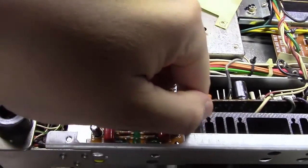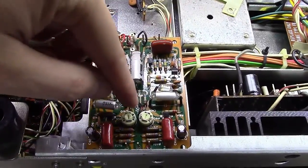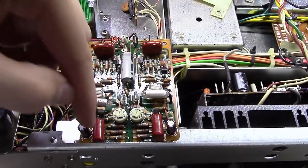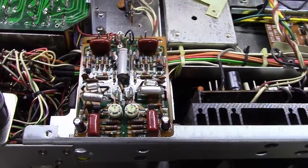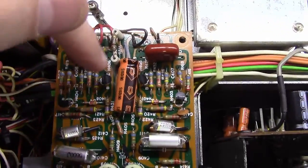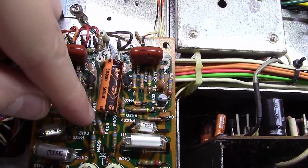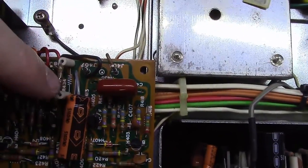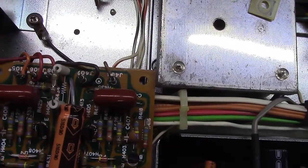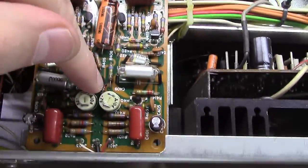We've now replaced capacitor, capacitor, capacitor, capacitor, and I've got this one and this little diode left — but isn't that a much sexier looking board now with these nice fat poly caps on there? We've got the new Sprague capacitor in. If you'll notice, I ran this lead pretty short and just tucked it straight down, but on this end it's a fairly long run, so I used a little bit of Teflon wire cover to get it down to the other spot. So far looking good — we've got this one little diode left to go.